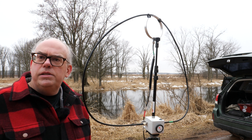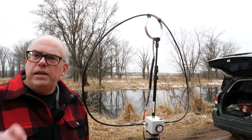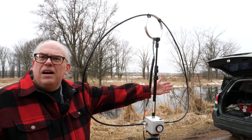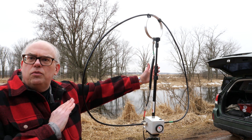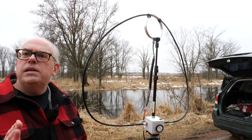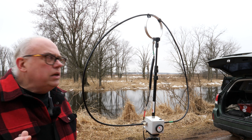It's a very favorite antenna for apartment or condo dwellers because you don't need a whole lot of space to set it up and you can get rid of a lot of that man-made noise. Third, it's a directional antenna — its major lobes are off the plane of the loop. I've got this antenna set up east-west, so hopefully the signals we receive come from the east and to the west of us. Let's look at the parts of the antenna and talk about a couple of the limitations.